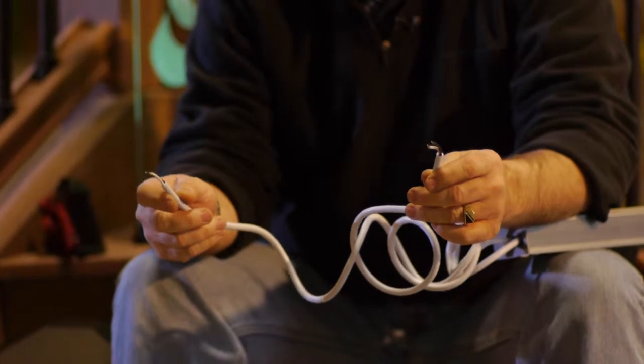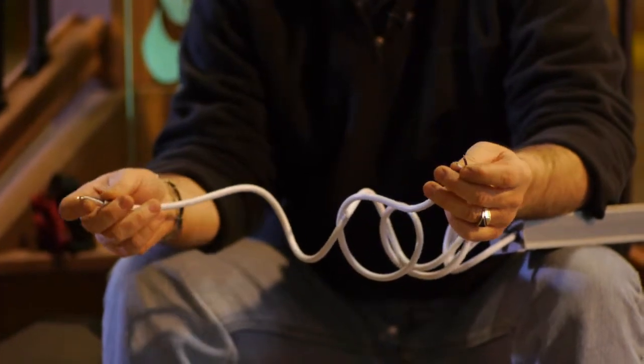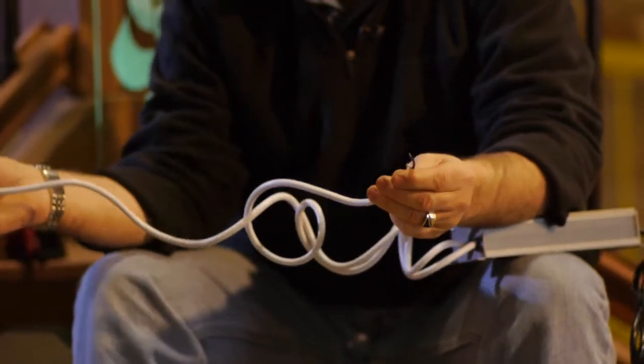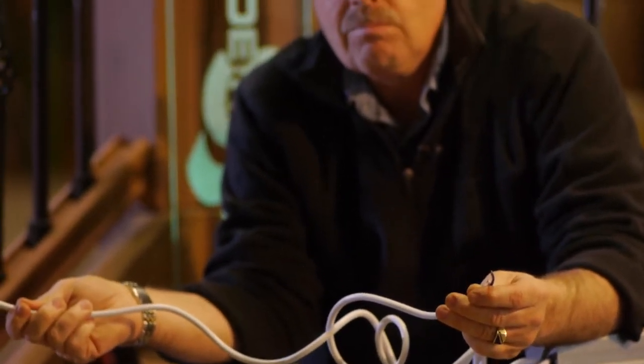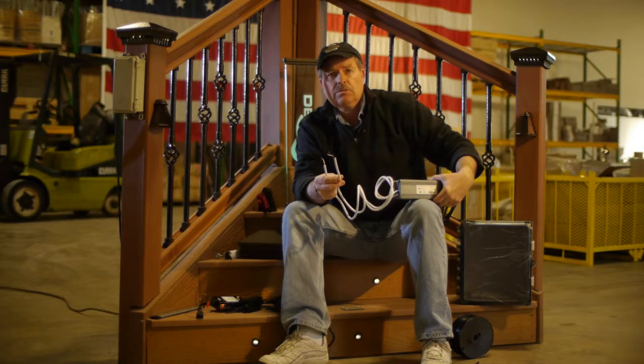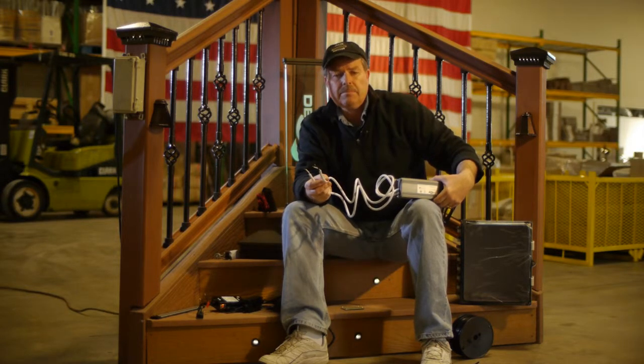Regardless, you can't exceed the amount of amperage coming out of the transformer. In other words, if this circuit has more lights, it's going to draw more amperage out of the transformer versus the other one, but the two will never exceed the total amount rating on the transformer, which is 8.3 amps.